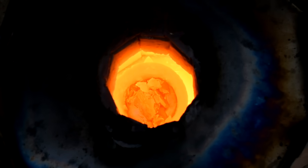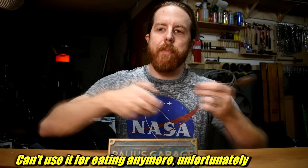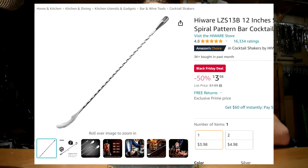Next up, a dross scooper. When you watch metal casting, you might see the crucible with molten metal and there'll be a skin or bunch of grime on the surface — and they take a scooper and scoop it off. I've been using a scavenged stainless kitchen spoon clamped on the end of some vice grips with a big leather glove. A better option is a stainless steel spoon with a small end and a very long handle. It's a good idea to have a longer handle because your hand will get very hot close to molten metal, especially with high-temperature metals like copper.